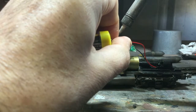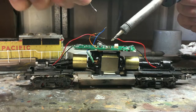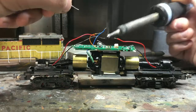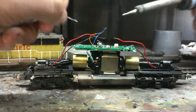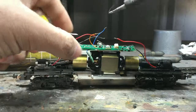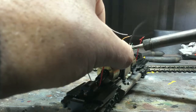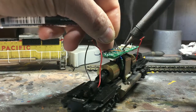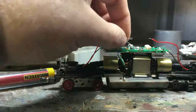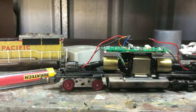I'm going to do a little bit of solder on the actual decoder itself. This is where the track pickups will go, and same on this side. Heat's not your friend here — you want to do a quick solder, you don't want to linger on the board because that's when you're going to run into problems. You can use this sort of decoder in any locomotive, but just be mindful it's not just a drop-and-play scenario — you're going to have to do a bit of hard soldering.